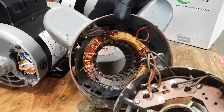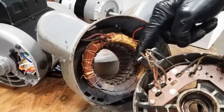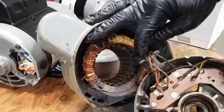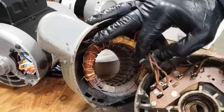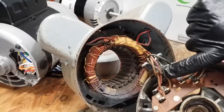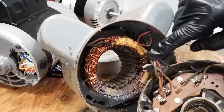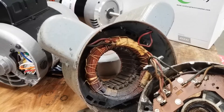When motors run, they get hot. Here's an example of a motor headed for the scrap heap — the connector wires coming off the main coil loops have insulation burned all over the back. Whether it was vibrating and shorted out, or it's just old, this is why motors fail. When insulation is missing, voltage can escape the wire, make contact with metal or an adjacent wire, and cause heat — which causes a thermal overload, which causes breakers to blow.